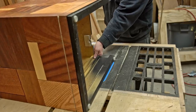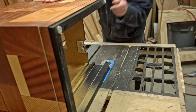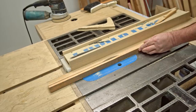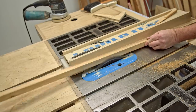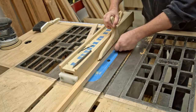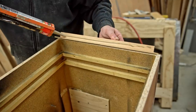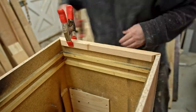That went well, but it did leave the bottom of the case looking rough. The body is made from particle board, so I want to cover that up. I'm making a molding from an old 2x4, cutting a rabbet that fits around that edge and leaves about an eighth of an inch of material on the bottom to cover the raw particle board. To install it I'm using more polyurethane construction adhesive — no pins this time, just clamped in place and left overnight to dry.